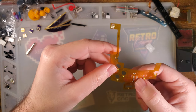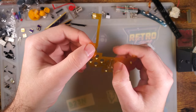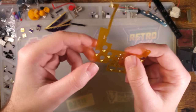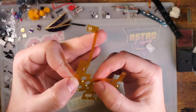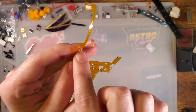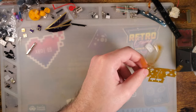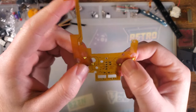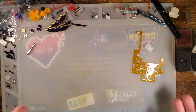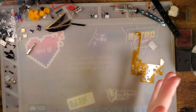There's really not a whole lot to it. It's just LEDs and resistors, and you do get the power LED there. So your power LED matches all your buttons. If you don't want to use the power LED — if you want to keep your stock red one, or if you've already modded it to a different color — you can literally just snip the ribbon off above the ground pad. Just cut with scissors, knife, doesn't matter. It'll still work all the same. There's nothing critical that runs through that power LED. It looks like all the LEDs are run in parallel off of the cart bus, so five volts. Pretty simple.